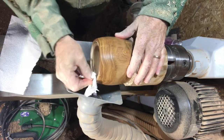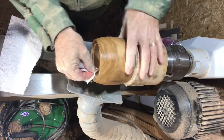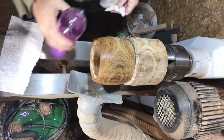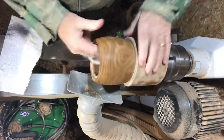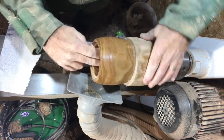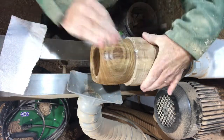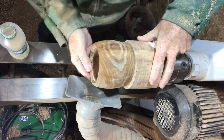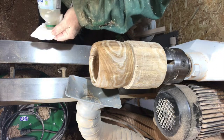So I would advise anybody, because if you put your sanding sealer on, all you're going to do is get that little dust just above or below the sanding sealer, so you'll get a little bit rougher texture to it. So you can see how much dirt comes out. So I would highly recommend it, and then we'll put a little bit of sanding sealer on it. If you just give it a minute or two to dry, it evaporates straight away with it having so much alcohol in it. So then all we'll do is just put a little bit of sealer in it.